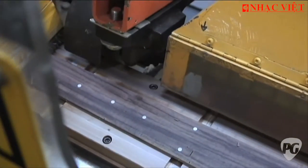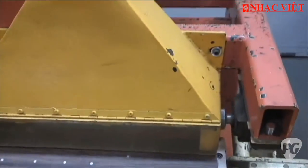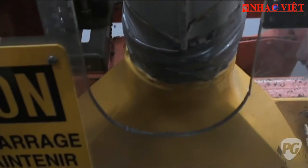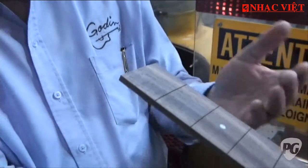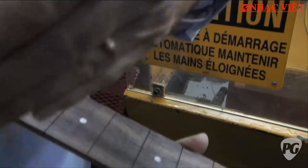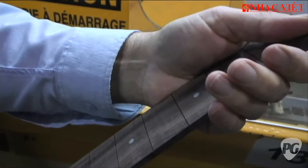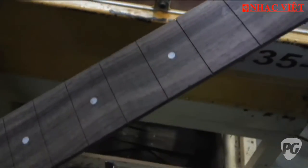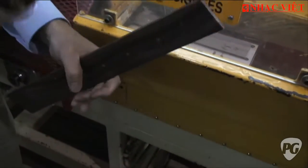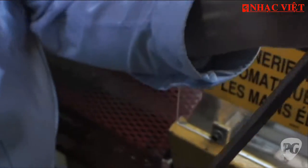Here is the saw — you're going to see all 22 frets cut in one shot. This is very important: the slot here is not straight, it's curved like that. Then we have more wood in the middle, so the fingerboard is much stiffer. Before, everybody cut the slot straight. But this goes round, and in the middle you gain about almost 30% more stiffness.